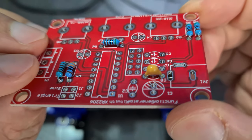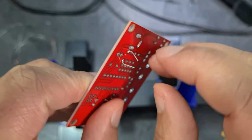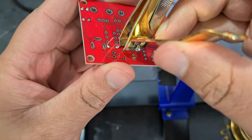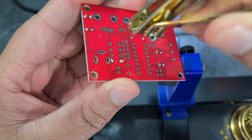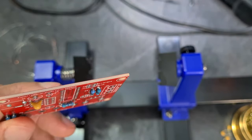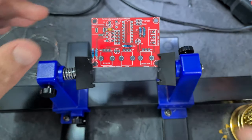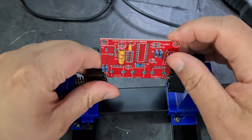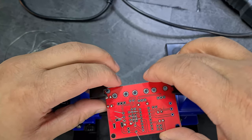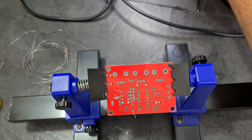Okay that's enough flux — I don't think that's too bad. The thing with bending the legs is it ends up going that way and then cutting becomes a problem, so just use nail clippers. It's not looking the best at all — that's to be expected with me at the helm. I'll put all the capacitors in even though they're not fully ready to solder yet.